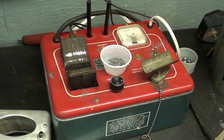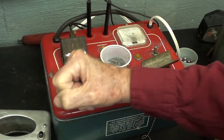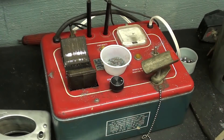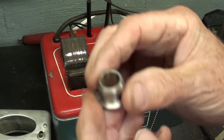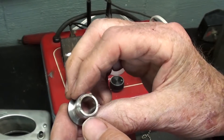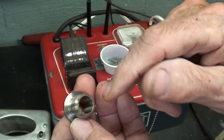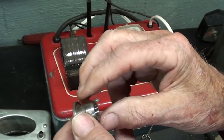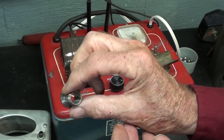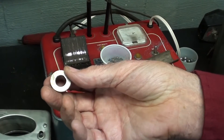And you could just feel the energy if you would grab a bar of steel and stick it inside there — it would hum with tremendous power. It was a $10,000 machine. And why did you demagnetize these? Because then they went into a second machine where the ID was ground, and there was a feeding magazine. And if they were magnetic, they would jam or they would not slide and zigzag and all that. So they had to be demagnetized.